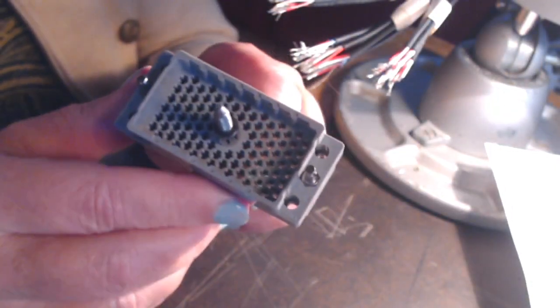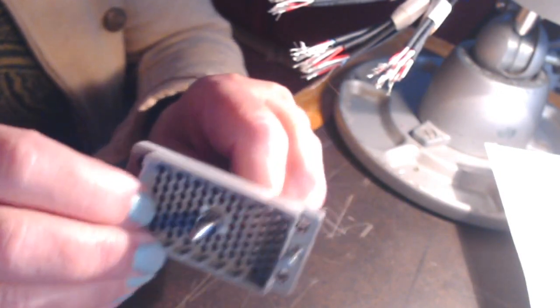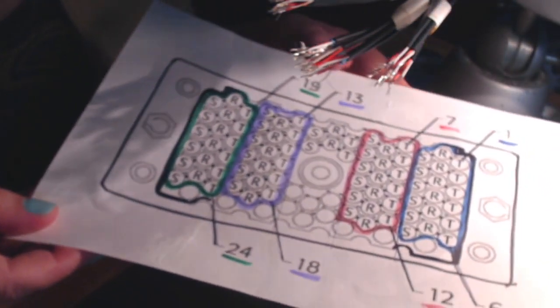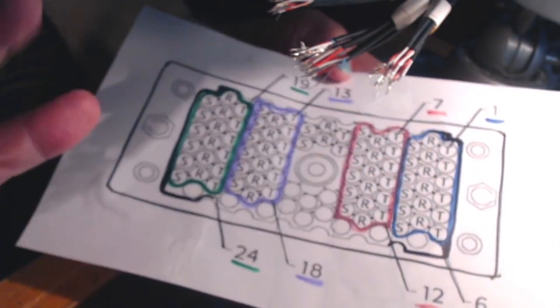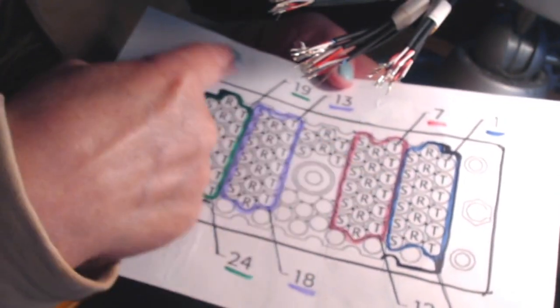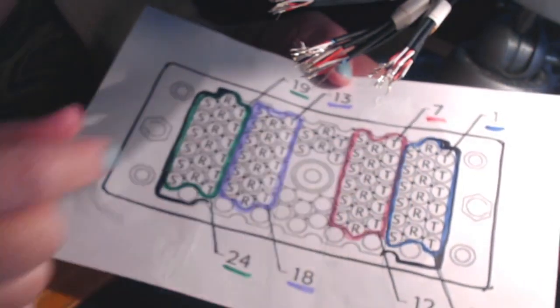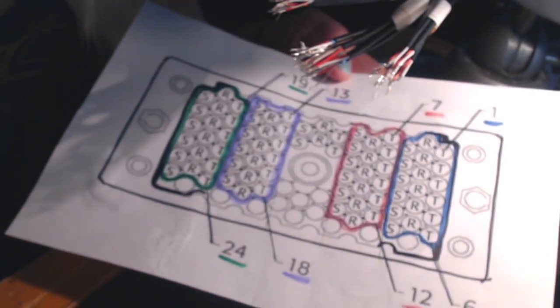We're continuing our project building Elco connectors for the new studio. This is a 90-pin Edac Elco connector, and I'm going to pin this one up next using this configuration. This is called the SAC, or Standard Audio Configuration, and I've divided it into 4 sections just to make it easier for me to understand. So channels 1 through 6 are on that row, channels 7 through 12 are on this row, and there's 4 sections with a 24-channel snake.